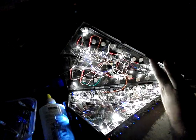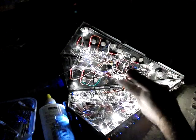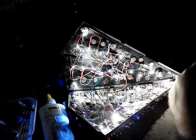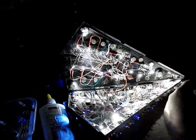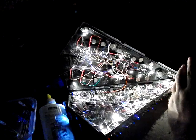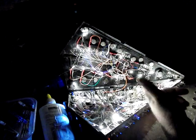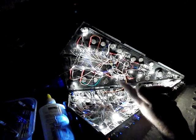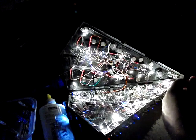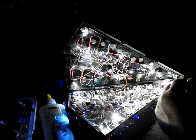You might be thinking that 50 LEDs is kind of a lot for such a small model. What I realized is that if I had done fiber optics for all the holes — of which there are about 600 — and each length of fiber was say 6 inches including the throwaway that gets clipped off, that's 600 times a half foot, so 300 feet of fiber. Pricing that out at about $20 per 75 feet comes to around $80 worth of fiber optics, versus 50 LEDs at 10 cents each, which is just five bucks. The math was pretty simple.